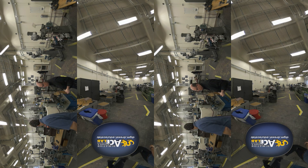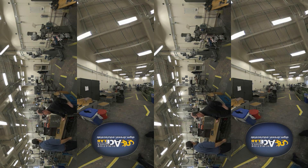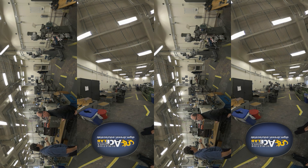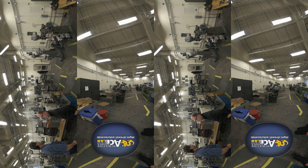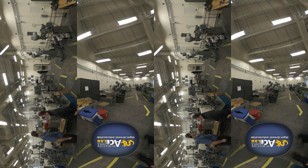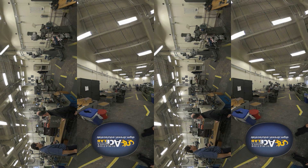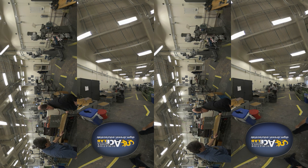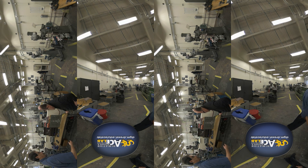Right here we have virtually every tool students are going to need. We have drills, center drills, and edge finders for the milling machines. We have hand tools for measuring — micrometers and vernier or dial calipers depending on who I'm talking to — and a variety of hand tools. If you need something more specific, grab one of the staff and we'll find whatever you need. We have a variety of parallels for the milling machines so you can set your work up inside vises, and all kinds of taps and expanding mandrels for specialized work such as drilling and tapping holes.